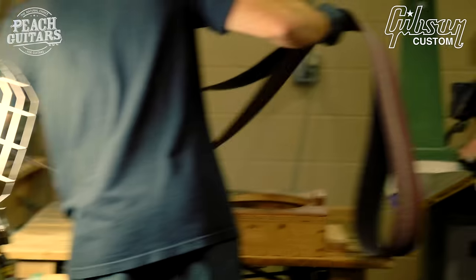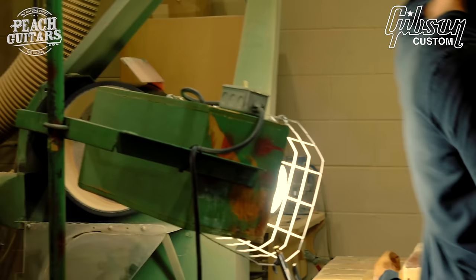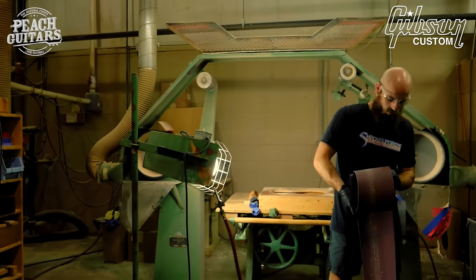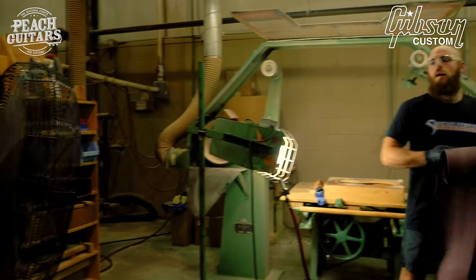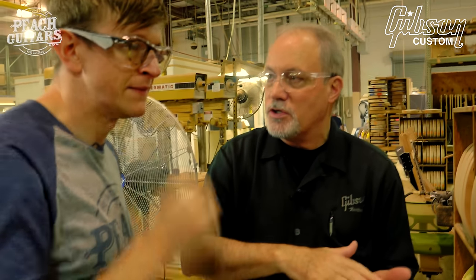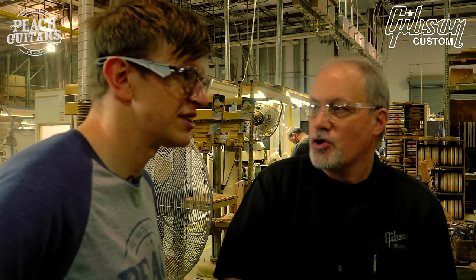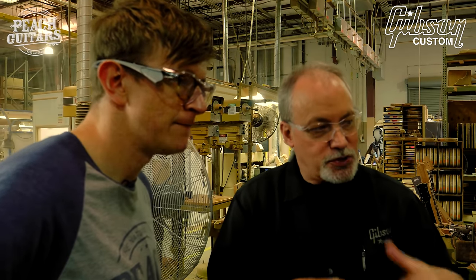Body held in there, and the table slides underneath the sanding belt, and he just uses pressure with the rag, or maybe a block, to hold the sandpaper down. All of his purpose is not to change the geometry and the shape of the top; it's to do another final smoothing. It seems simple, but he understands the mission is: you don't mess with reissue specs. His job is to just make it smooth but still keep that relief carve.